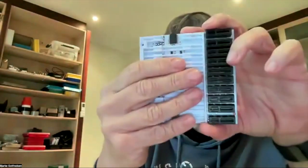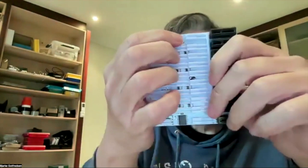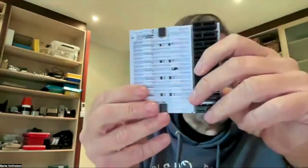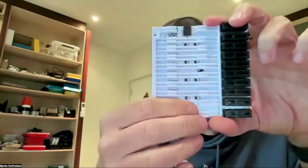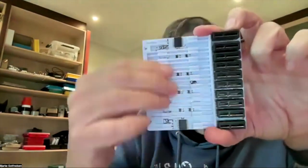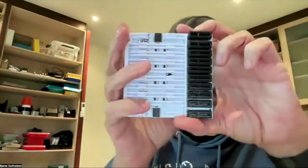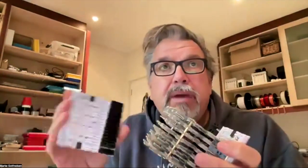What's also updated is that there was a problem where this control board gave power high when it started up, so I had to reverse the logic. Now there's no power on the board when it starts up. The reason for that is that each board also has a power sensor that measures each board's current and voltage. If anybody exceeds the allowed current and voltage, it will shut off. That's getting measured, and when Jim puts it together, he will be able to connect to this thing using his laptop or phone. It's just going to be a web page he logs into, and it will give a status of everything.